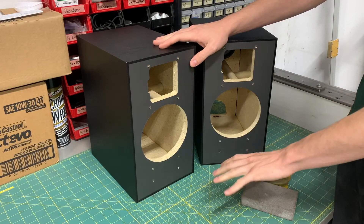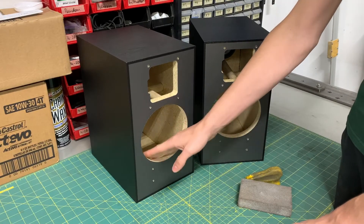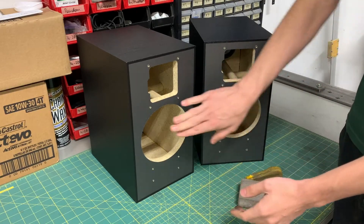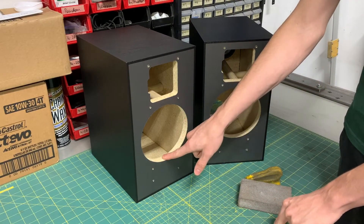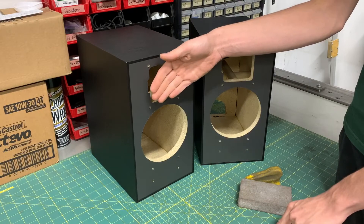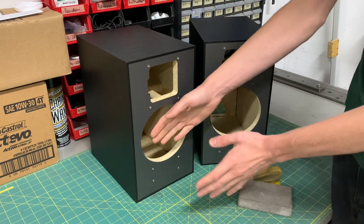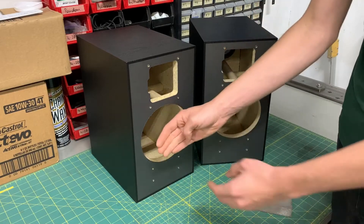Now we're out in the shop because this is a bit of a messy process. I'm going to use some sanding tools to smooth out the woofer cutout here. The purpose of this is to minimize diffraction caused by sharp corners — ideally on any speaker, everything would be nice and round to minimize diffraction. You only need to do this on the woofer, not the tweeter, because no sound goes through that area. The tweeter sends all sound forward, whereas the woofer is open on front and back, producing sound on both sides, 180 degrees out of phase in the back.